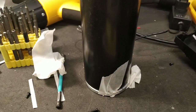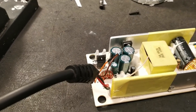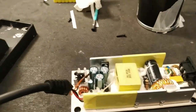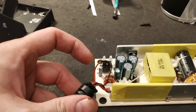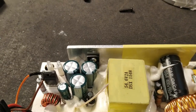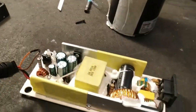This means if you have this piece of crap battery, you can replace it with any other charger. I would use a four-pin XLR because it will fit fucking perfectly in here. You have four pins, so you can connect these two to pins two and three, and use one for positive and four for negative — that's usually the standard for four-pin XLR. Why the fuck does it say 44.6 volts? Is this a 48 volt battery? Yeah, it's a fucking 48 volt battery.